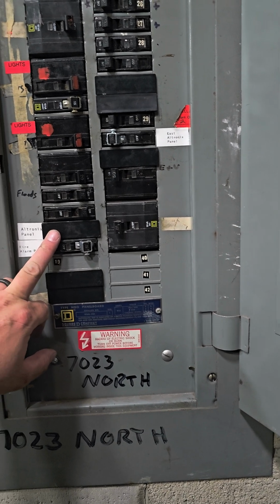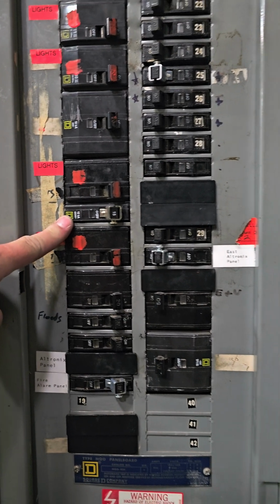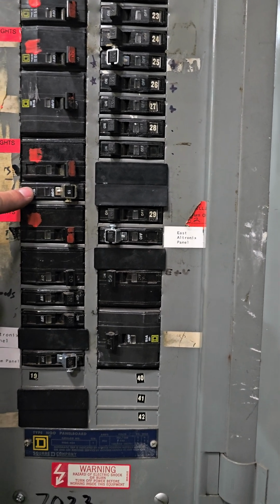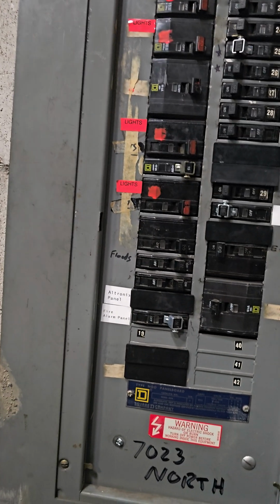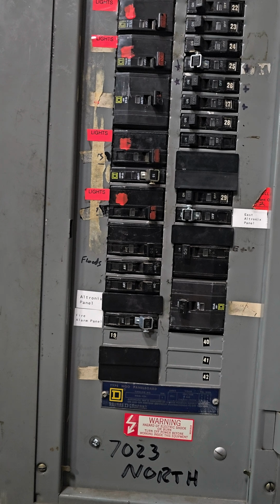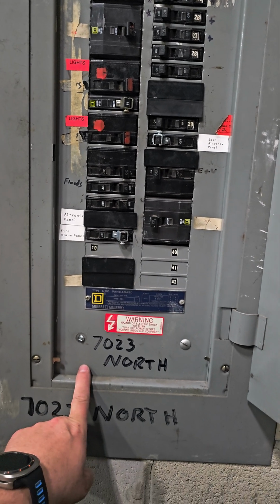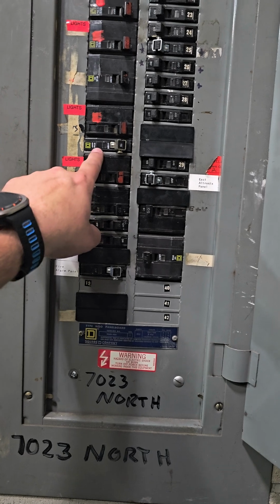So I run out to my truck. I had a Square D QO breaker, which is this breaker now. And yeah, it's not on the same phase. They're on separate phases. And boom, the panel came back up. Problem is there's also an east and west expansion panel for the alarm. And the west panel is on phase B on here. So phase A was working on here, because at this point I'm like, why is my breaker down here not working before I switch it up here?